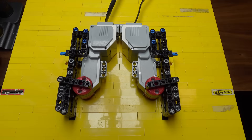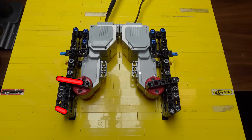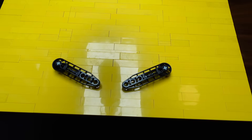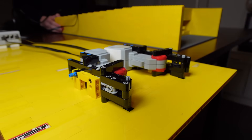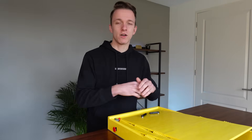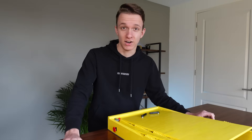This is what I settled on — a large beam attached to the motor and a small beam attached to the flipper. This allows for fast movement without the need for gears. And as you can see, this allows for enough action during the game and assures you will actually be able to score some points high up. Now that we've got the core functionality, I'm going to start fleshing it out and making it more complete, then start thinking about the design.